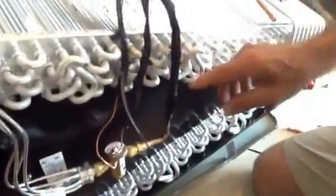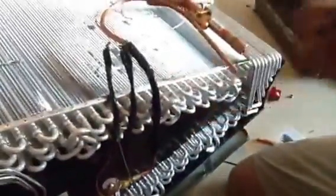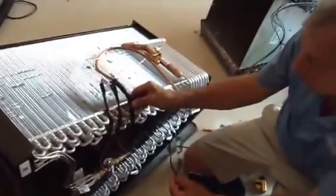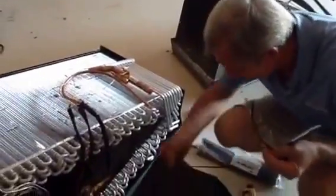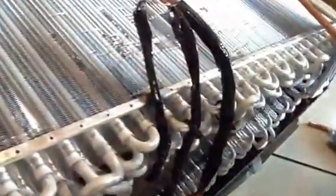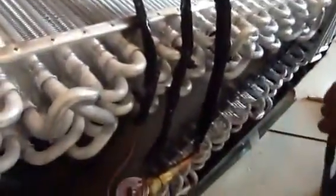Now here's one thing I really want to point out. Because you have aluminum and you have copper, it's two dissimilar metals. So if you let the copper touch the aluminum, it will corrode and leak. So the most important thing I can stress: any time your copper touches any of the aluminum parts, you have to tape it. See, all I did was tape it and put a tie strap into it. Very important, because if you don't, you'll come back in about six months, maybe a year, and this will be totally leaked out — and that will be the problem.